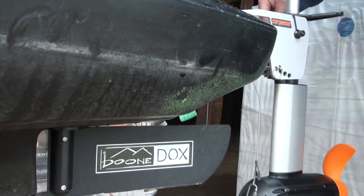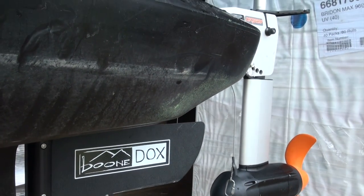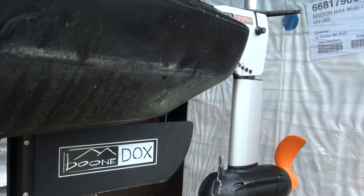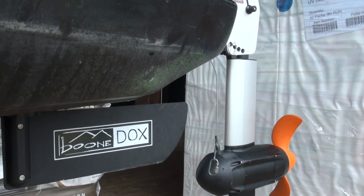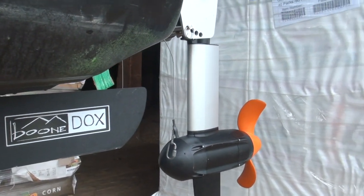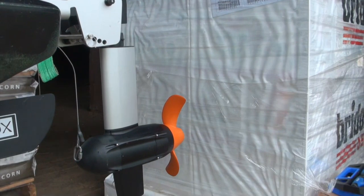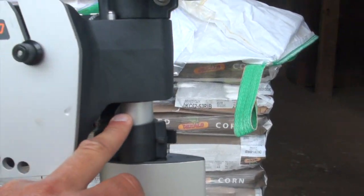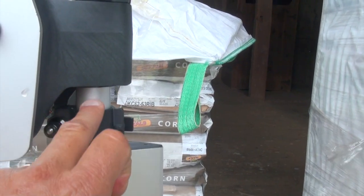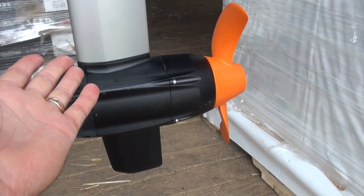Okay, so you can see his mud line here, and you can see that that propeller is below it by, how many inches do you say that is? 10? 8 to 10? I don't think it's quite that much, but it's plenty. This particular prop is very good at not ventilating, so you're plenty deep enough. If you wanted to, just for the shallow running that you do on rivers, you could go ahead and eat up this little bit to get it higher. You want these as high as they can possibly be